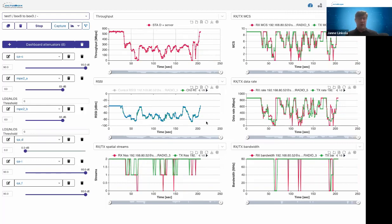And so in this way, this becomes independent of the measurement device as well as of the access points being used. We end up with the path loss, and then we can apply this path loss profile to basically any device under test. And if we use other stations for the test, then we would have to calibrate it a little bit, but it's a relatively simple calibration.